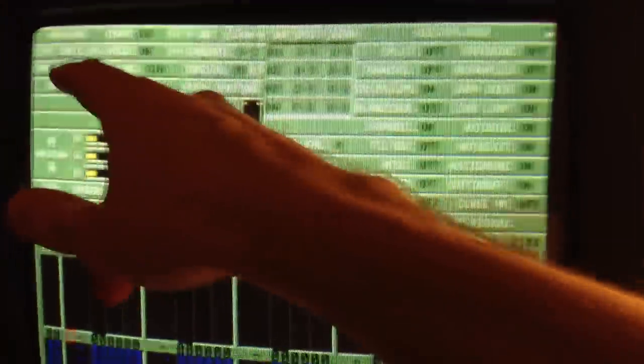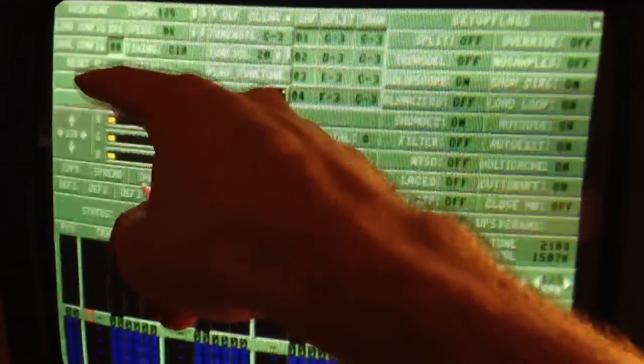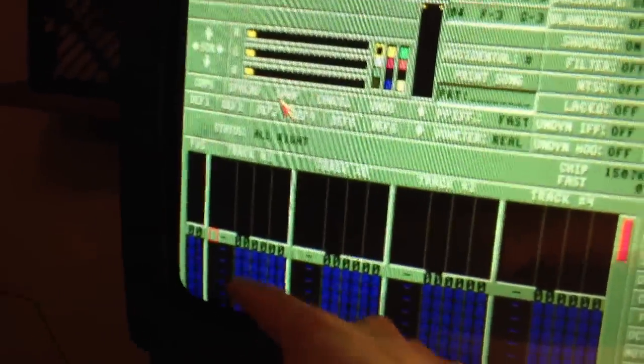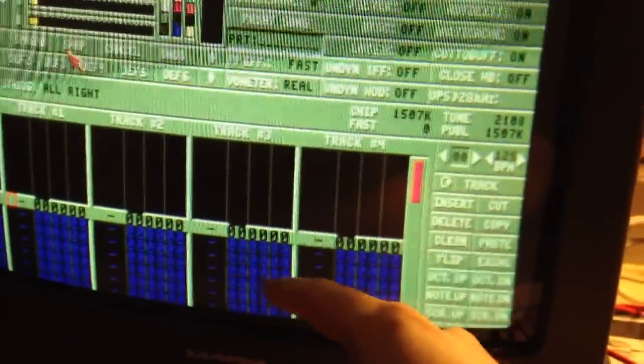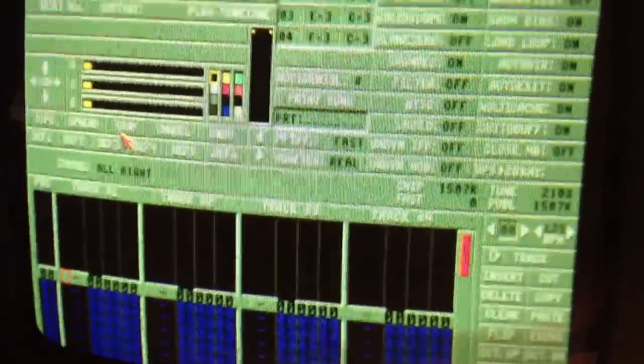So when the lines are being drawn on screen like this, when they are reaching the blue area, then some of the data bits are going to go high. And I don't want that, because it's more difficult to see on the scope what's going on. I only want the data bits to go high when I move the slide bar. I don't want any other portions of the screen affecting my reading on this oscilloscope. So then how can I solve that problem?